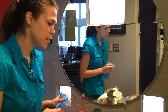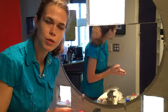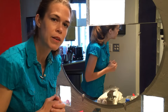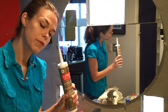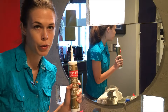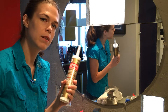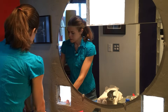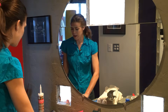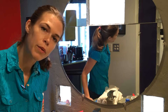You probably don't want to get this sealer on your hands either. For the final finishes, I never fully trust grout around the edges of the shower to stay in place and keep from leaking, so I got some silicone caulk specifically designed for shower use — it's supposed to be mold-free for 10 years. I've used it in my other bathroom with great results for about five years. You'll need the caulk, a caulking gun, and a small utility knife to cut the tip off.